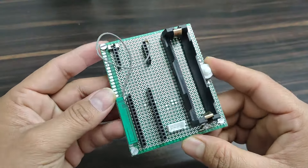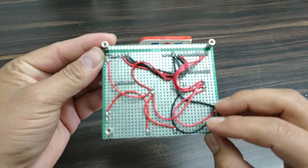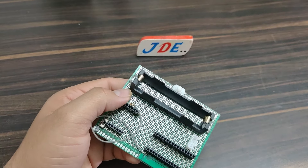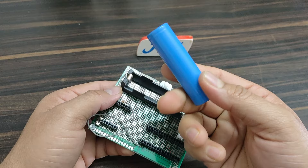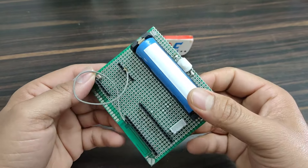These are the required components. I'm designing a PCB — we put all the female headers on a zero PCB along with the battery holder, and now I attach all the components one by one. First I connect this lithium-ion battery, which is a rechargeable battery providing 3.7 volts.